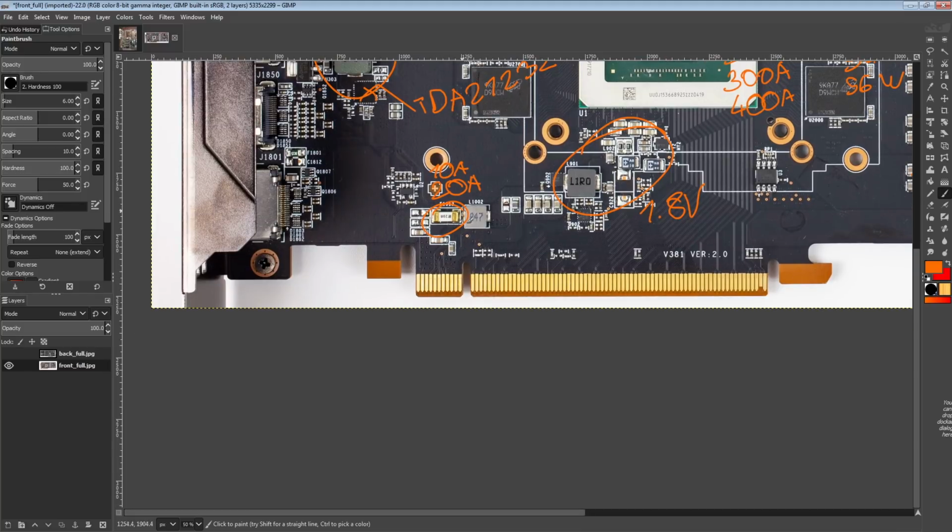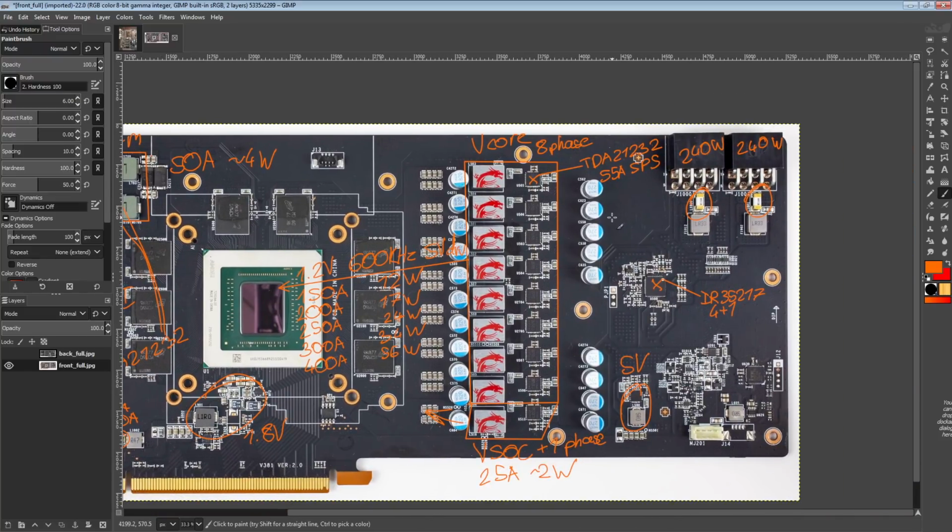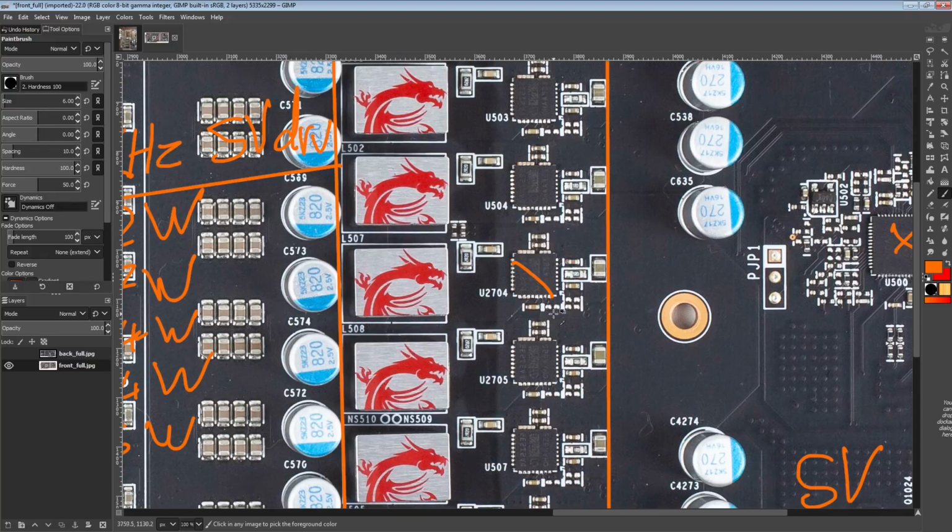So I would have preferred to see a 10 amp down there instead of a 20. But still, the fuses here don't stop the card from failing. If a fuse blows on a GPU, replacing the fuse does not fix the issue. The fuse blowing is a symptom, not the cause. The fuse is there to protect the card from further damage if something blows up. So let's say one of the VCore VRM power stages blows up.